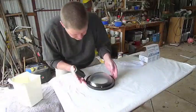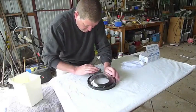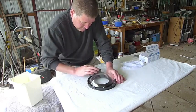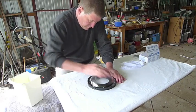Every now and then you'll need to stop and dry it off to see if the scratches are still there. That shows the fine scratches from the sandpaper. This step took me about an hour. Just going back and continuing — a few of the scratches were still visible. Always sand in only one direction.